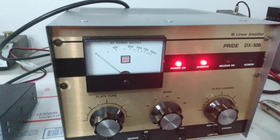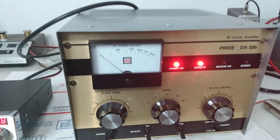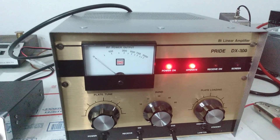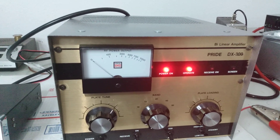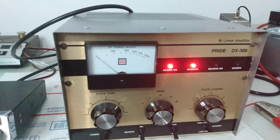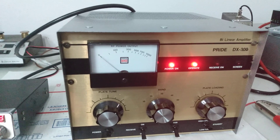Internal-wise, what's been done to this thing — it's had the Nomad upgrade boards done to it. If you know anything about the Pride DX300, you know that's almost an absolute must if you're wanting to keep one of these. If you're just buying one to flip it and sell it for $600, $700, $800, a lot of people don't go through the trouble to put the boards in it. But the first thing I tell people when they get one of these: put the Nomad upgrade boards in it or you're going to have a failure — maybe a year down the road, maybe two years down the road. The Nomad upgrade boards are a must and this one has it.